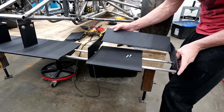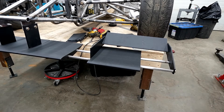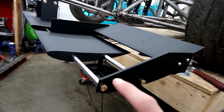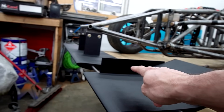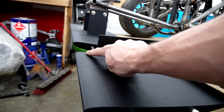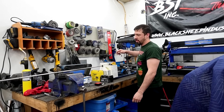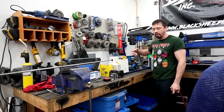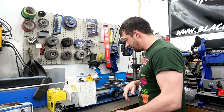Now we should be able to put the entire length of this upper element in here. It isn't perfectly lined up right now and there's only one element over here, but dang that's cool. Obviously these end plates are gonna be a little bit longer and taller - this is just all I could fit in my 3D printer - same with this one here. It's going to extend and have a radius to it and go all the way up to the top. I'm just gonna chuck our big long rods in the lathe - they do fit in the lathe - and just square off the ends to make sure when I put the rivet nuts in they're flush and the bolts don't go in sideways.